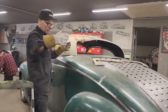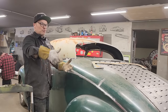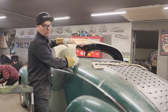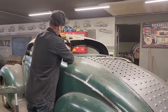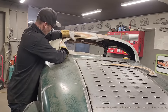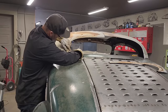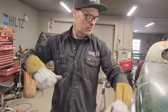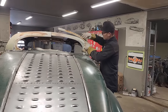Basically, you watch sometimes the people pulling out dents and fixing fenders and filing them and all that stuff, but they have stretched the fender out further than it really was before in order to get that excess metal to go, not away, but visually look good. So you really have to be careful. If you're watching somebody pick and file metal so it looks excellent again, you have to think about how much material they are getting rid of when they run a file over the top of it. You're shaving off metal and making things so thin that it's a hard deal.